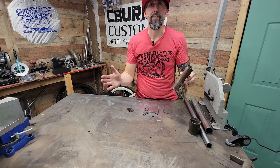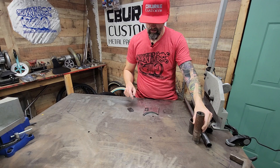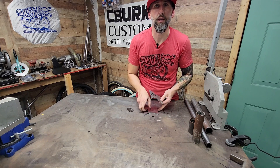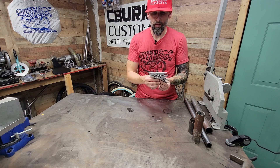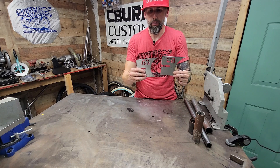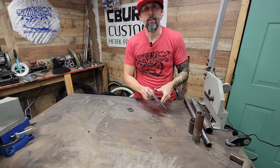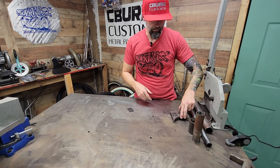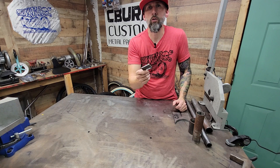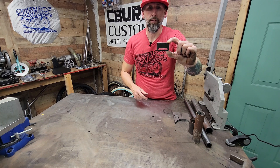This is what's known as a bottom bracket — you can source these at Chop Shop Customs, link in the description. The bottom bracket is where your pedals go; it holds your entire pedal assembly. Head tubes are also one-and-a-half-inch tubing but with a 0.083 wall diameter. I make my own head tubes — you may need to grind the insides out a little but they work great. You can buy them by the stick. These here are called dropouts — this is the end of the bike where your wheels mount. I get these plasma table cut over at Gearhead Customs; he also cuts coaster brake brackets, which I like to include on most of my frames.